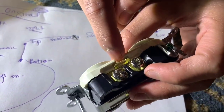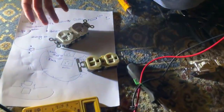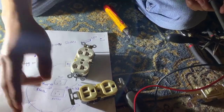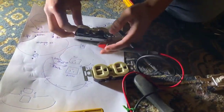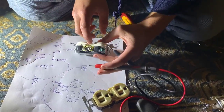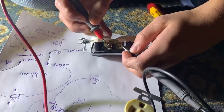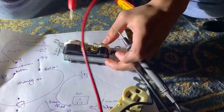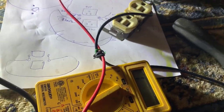You can see what it looks like before you pry it out, right here. Your initial worry when doing this might be: what if it's connected internally? What if there's just a bridge just under this plastic? In order to test that, you can use a multimeter to test continuity, or ohms. You'll notice that when they have a bridge next to them and you connect the terminals, there is continuity detected. But after you take off the bridge, you can see that there's not any continuity at all.